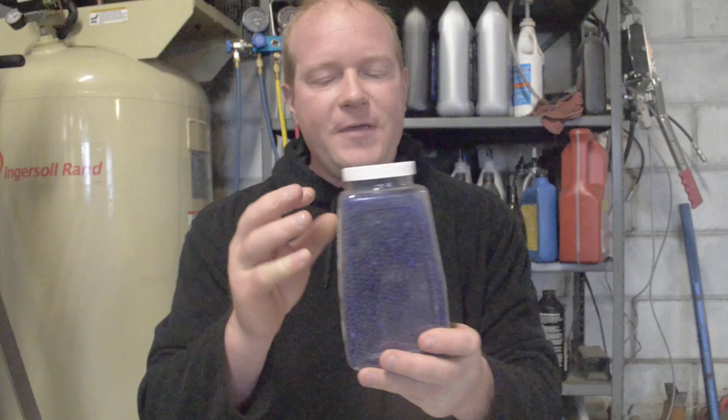What is desiccant? Desiccant is these little beads designed to absorb moisture — think of them as the 'do not eat' packs that you get in electronics. This is replaceable desiccant that gets any vapors left over before coming through. The first filter gets large water particles that drain out the bottom, the second regulates oil and particulates, and then the desiccant catches any remaining moisture.